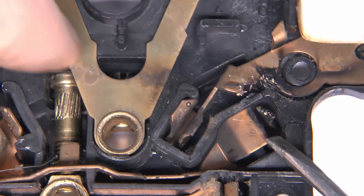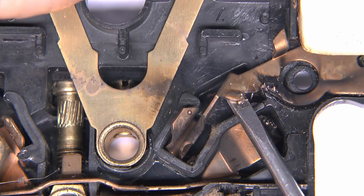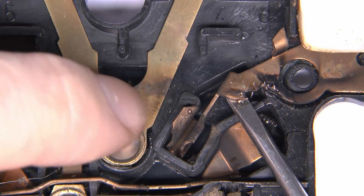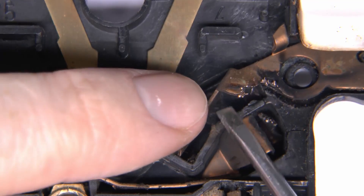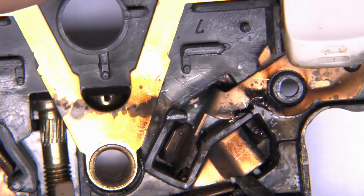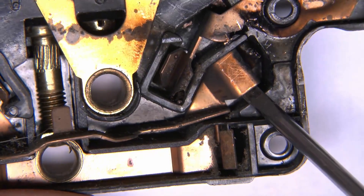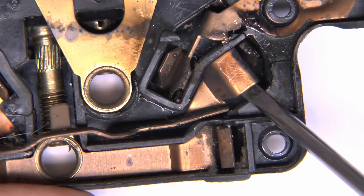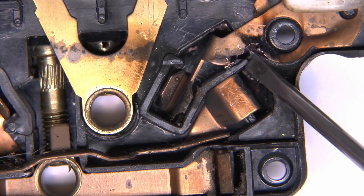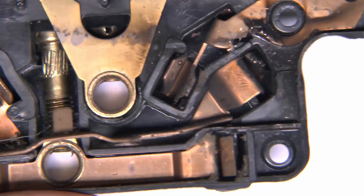Now just back on the socket here — you can see this contact here is actually quite loose. So if the plug pin had got stuck there, pulling it out would have caused this to lift, and then it's way above where it should have been. And also this one here, which is the one that's most severely damaged — that contact there certainly does move within the base. So it certainly looks like it was just unfortunate that it pulled them up, and then there was enough gap for the two to make contact with each other.